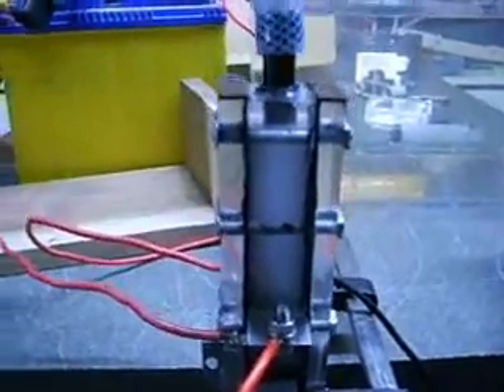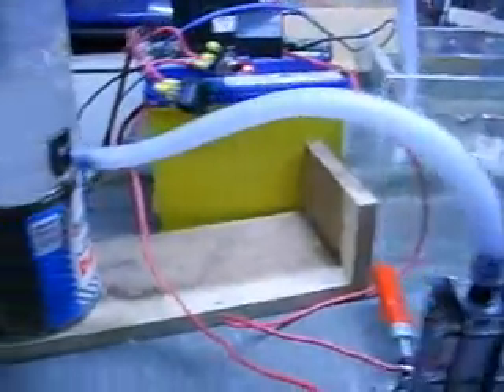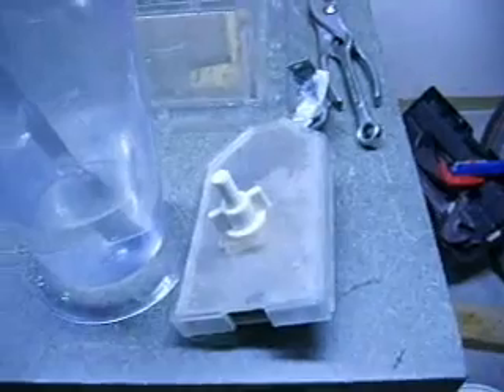I love this little viewing window here. So what I'm going to do is add some more electrolyte into this mixture and crank the amps up. As it is right now, sitting on four and a half amps, it is producing 250 millilitres a minute. Now that's not spectacular as far as what some of the other cells out there are producing, but keep in mind that this cell is only seven plates, even though it looks a lot bigger — it's not really that big. And it's already producing about 50 millilitres more than what this cell was producing, so it's actually producing more than any cell I've got.